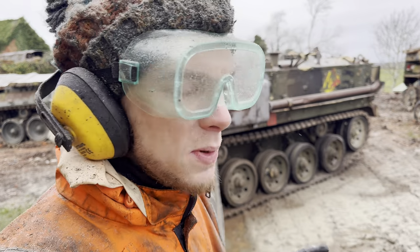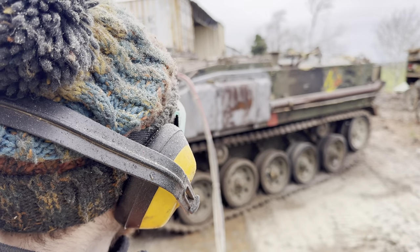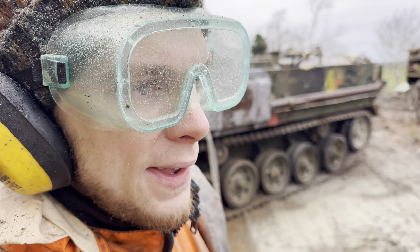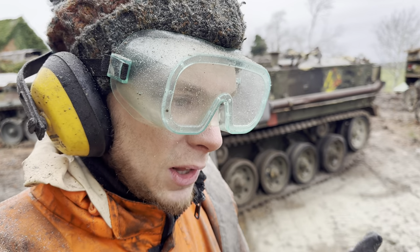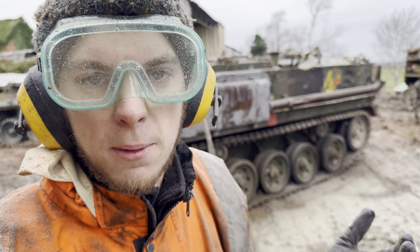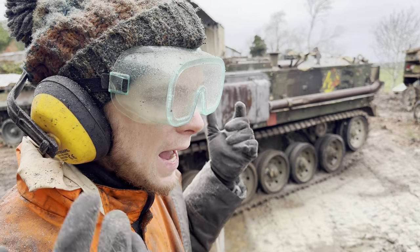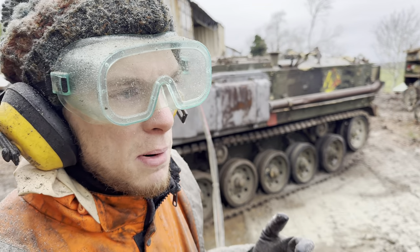easily 3 hours with a needle gun, especially tin work. If you see, I flashed over some tin work there with a needle gun, because tin's thin, it vibrates, and that loses the efficiency of a needle gun. Needle gunning tin work, for people that have done it, is horrendous. Very loud, terrible on the ears. This isn't actually that noisy. You can put the compressor out of the way.